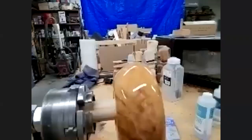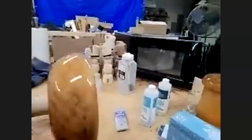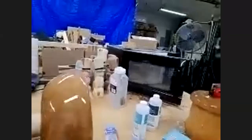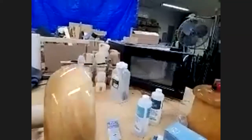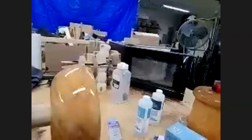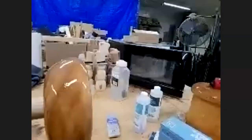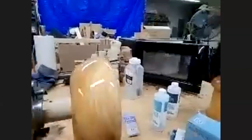I love that finish. The finish turns out real good. That's the kind of shine I'm looking for — it's real shiny. And when you build up the coats on here, it really looks deep in there — real pretty. The first coat has a lot of bubbles and different things, but the next coat will level it out more. If you keep going, they just keep leveling it out. John Williams doesn't even sand the first two or three coats. After three coats, then he sands it, and then he puts on two or three more final coats.